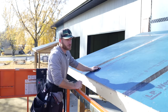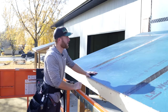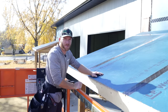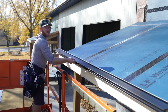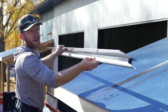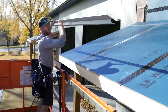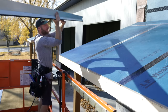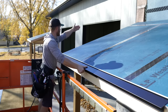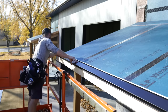We just got that delivered yesterday, and I'm gonna go ahead and start trimming this out so we can get our dimension, cut our panels exactly, get our hems on them, and then start installing. I know we've gone over this whole standing seam thing, but make sure you leave yourself some material out there on the end, and you do a nice little bend over. That'll give you something to rivet your connection on your rake trim down to this eave, this extended eave, later on.